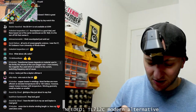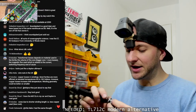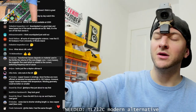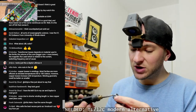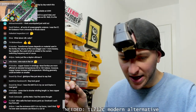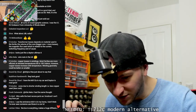The most important factors in a car audio system for it sounding nice and sounding loud are going to be enclosure, positioning, and power, like power supply. Not amplifier brand or anything. I just mean the amount of power that you've got available and dynamic headroom. If you get the enclosure right, you get the positioning of the speakers and the subwoofer correct, and the acoustic side of it correct, and you have power available, then you can pretty much throw in a whole range of different brands and price levels of equipment, and it's all going to sound pretty good and probably not going to be worth the extra money on something that's twice as expensive.